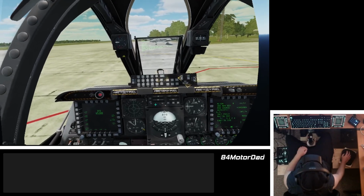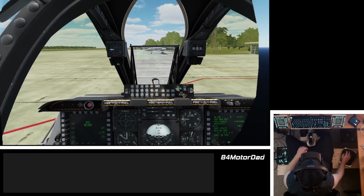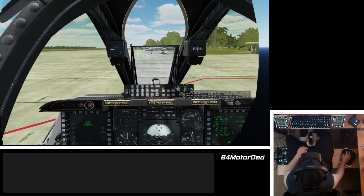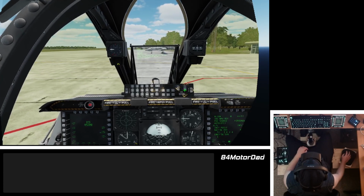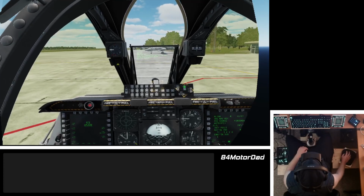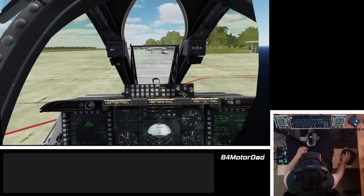The IFFCC is now displaying the ground bit menu on the HUD, where you can run a number of other bits if necessary. To exit out of this menu, press the Select Rocker key on the UFC down repeatedly until the HUD cursor points to exit again. Then press Enter to exit this menu.